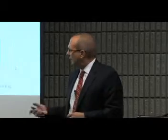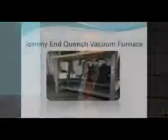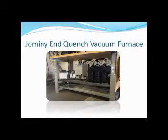Just as of Saturday we got our first actual good result. We took it up to four bar pressure and we're matching my atmospheric results on that furnace — but that was just for 4340. My real key interest is how this will perform at 10 bar, since we built this to 10 bar pressure, specifically to look at 4130. Increasing the pressure with the 200 mile-per-hour gas velocity. It's a permanent test stand that we'll be looking at many different alloys with in the future.